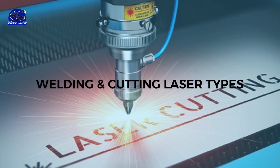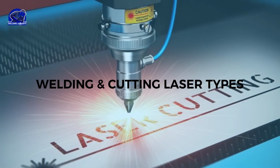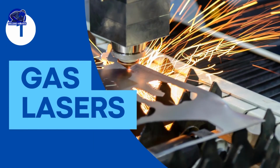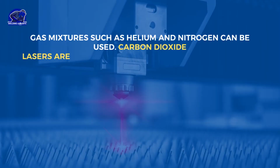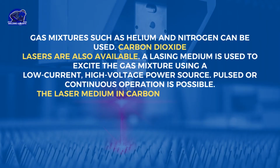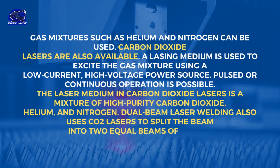Welding and cutting laser types. Lasers used primarily for welding and cutting are gas lasers. Gas mixtures such as helium and nitrogen can be used. Carbon dioxide lasers are also available. A lasing medium is used to excite the gas mixture using a low current, high voltage power source. Pulsed or continuous operation is possible. The laser medium in carbon dioxide lasers is a mixture of high purity carbon dioxide, helium, and nitrogen.